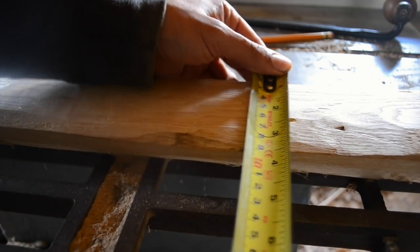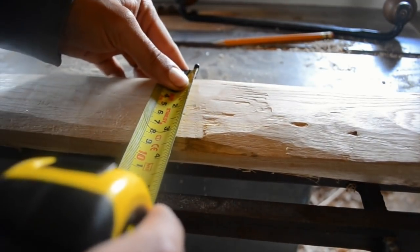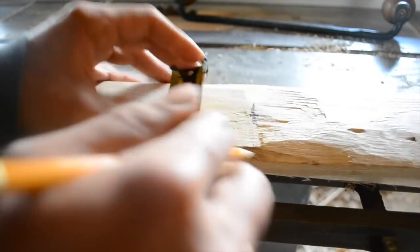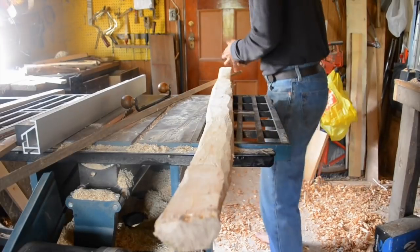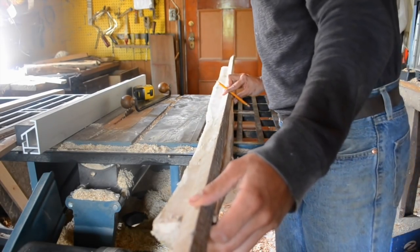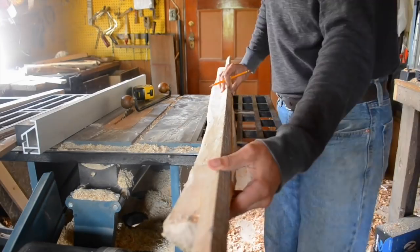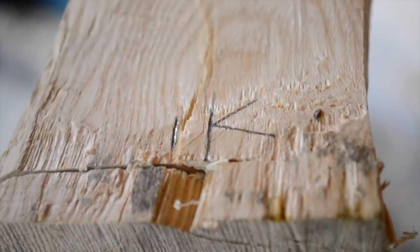Then you measure the width of the bow at the top and the bottom of the handle. You're going to want the two of these to be more or less the same, so if they aren't you should mark them to the lesser — 3 and a half. Then you mark the center line of the handle: 1 and 3 quarters. Then you go to the tip, measure the width and mark the center up there as well. Once that's done you get a chalk line or a straight piece of wood and you try and line up all of those center points. Unless you're very lucky you won't be able to get these to line up perfectly so just choose the best compromise you can — it should be correct near the center of the handle at least. Once you've found something you're not unhappy with, mark it and be sure to put a little x near it to make sure that you don't forget which mark is which.